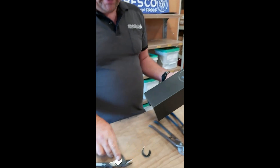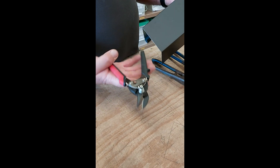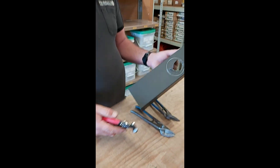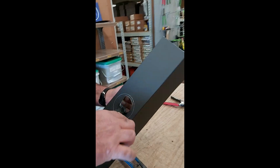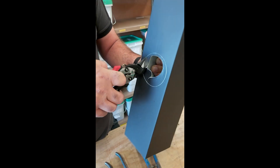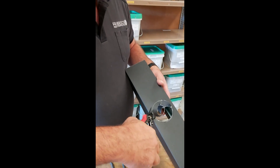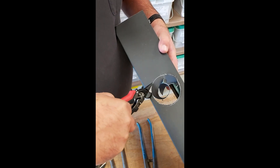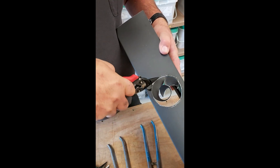Then the new ones are those mini snips here. A lot of our Spartan guys are using those ones, the D15A and D15AL. Because they're so little, you can really go step by step and cut right into the corner. You use that snip and leave it flat on the ground and cut along those lines, without scratching the outside.